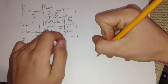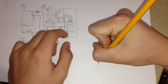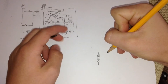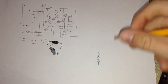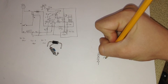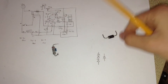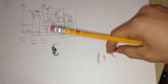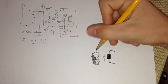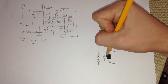The schematic for a selenium rectifier looks like multiple diode schematics all put together. That's what a selenium rectifier schematic looks like. But a diode schematic is just a normal silicon diode. The one thing that's different between silicon diodes and selenium rectifiers is that selenium rectifiers have a higher internal resistance than a diode.